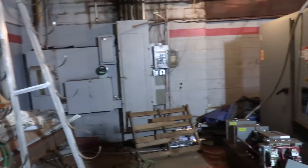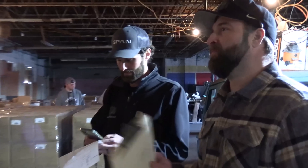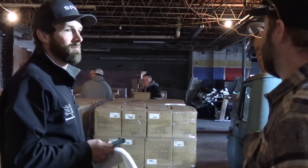Desired course of action — trying to salvage and repurpose to keep costs low? Yeah. From what I can tell we have 600 amp three-phase — looks accurate. 600 amp total in meter base back there. Four of them are combined and then we've got a standalone. We'd like to try to use those. We've got one, two, three retails, warehouse, and then house power — split it five ways. Which of course allows us to push all utilities to the tenants. Do you need a house meter for exterior lighting or associated with the tenant? I think we put all common space and exterior on house — so one house meter.